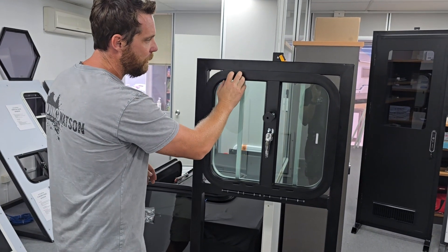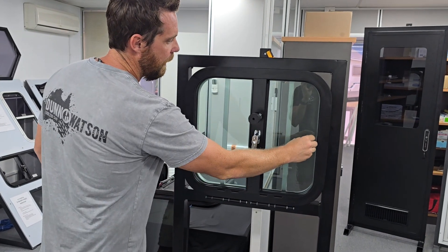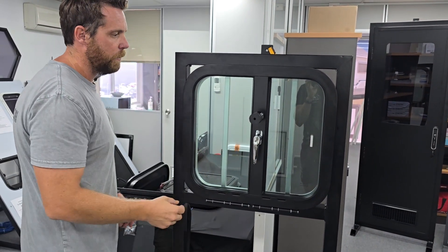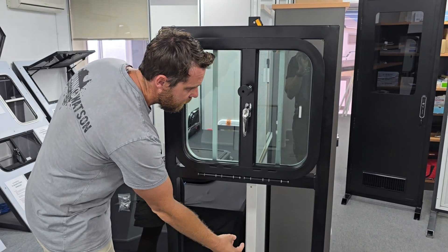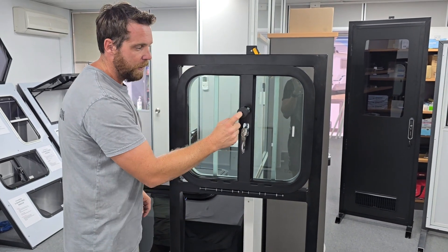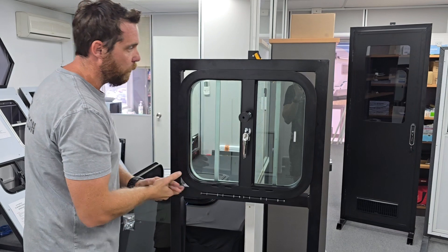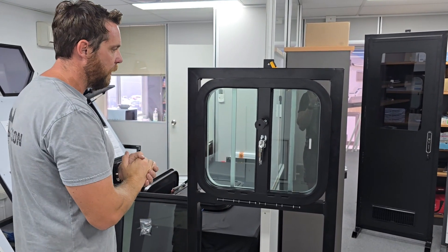You'll notice it's an aluminium frame, it's a glass window, it's key locking, and currently that window is locked internally as well. You've got a rubber stopper here and the idea is that it is screwed to the below section of your float. As your window comes down, it's going to recapture onto this keeper and keep your window firm and still while you're working through it.